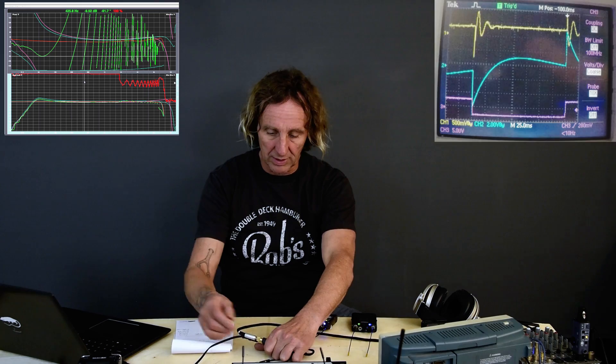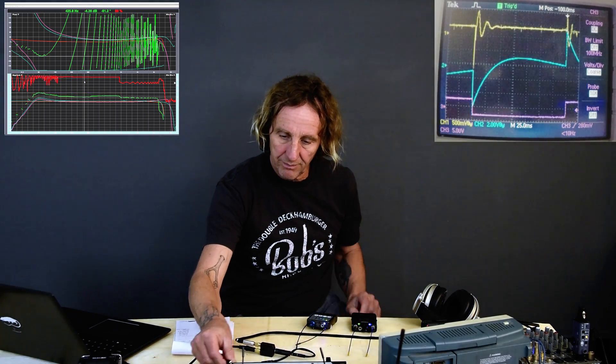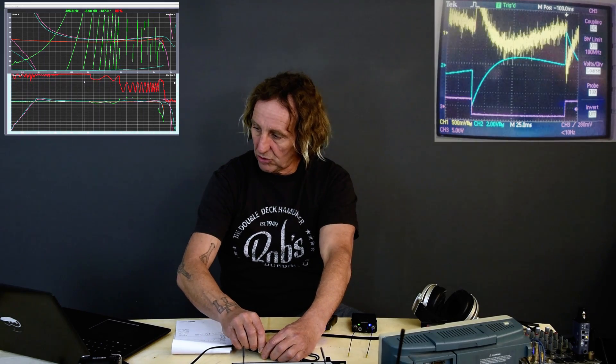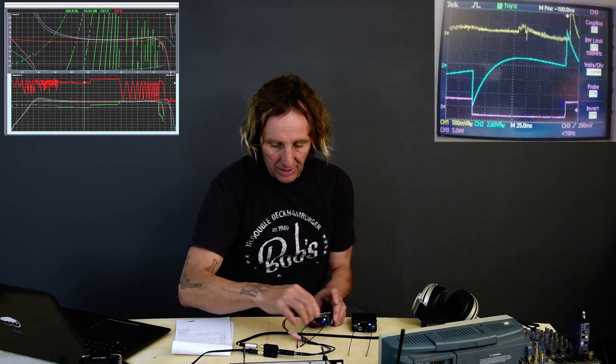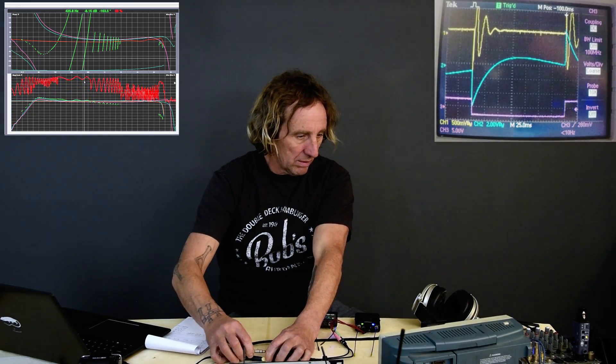Headphone drops — we did that earlier. We could do that with pulse and look at it on the scope, so let's try that again. We definitely saw a jump there — that's the one we saw the big jump with on the Shure unit and the front panel of the Lectrosonics. We see no change in level with the belt pack of the Lectrosonics. We see a slight change with the belt pack of the Shure.